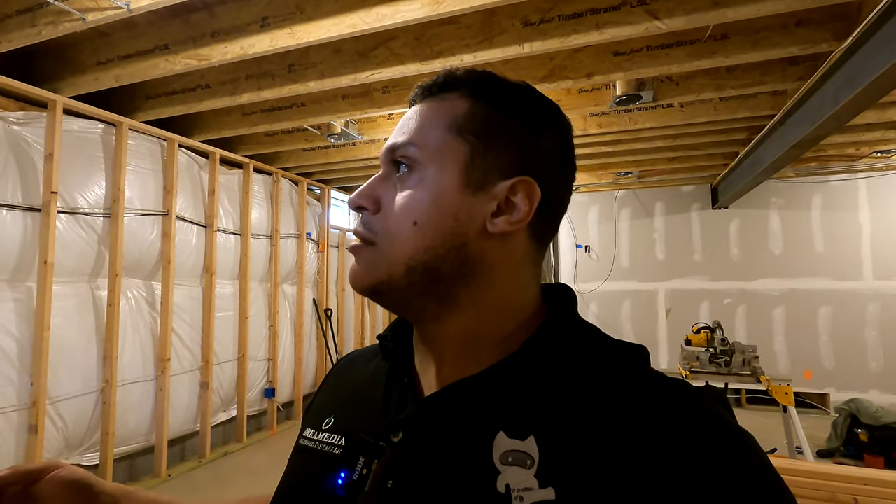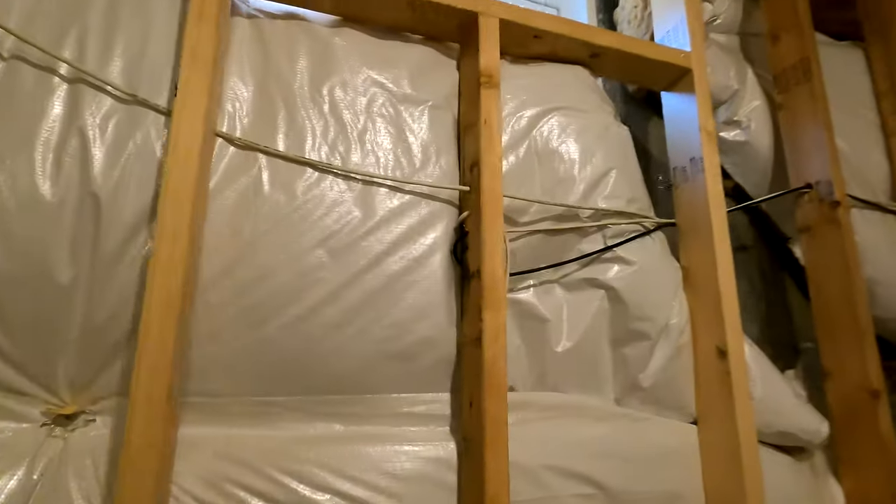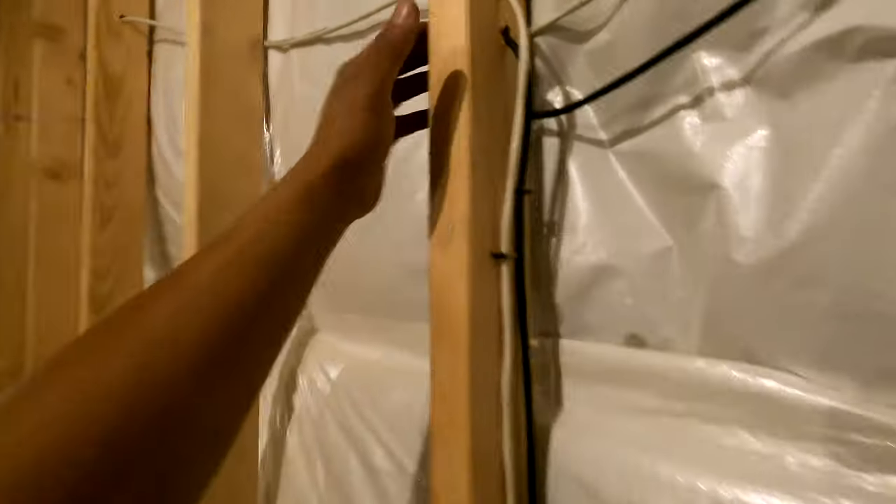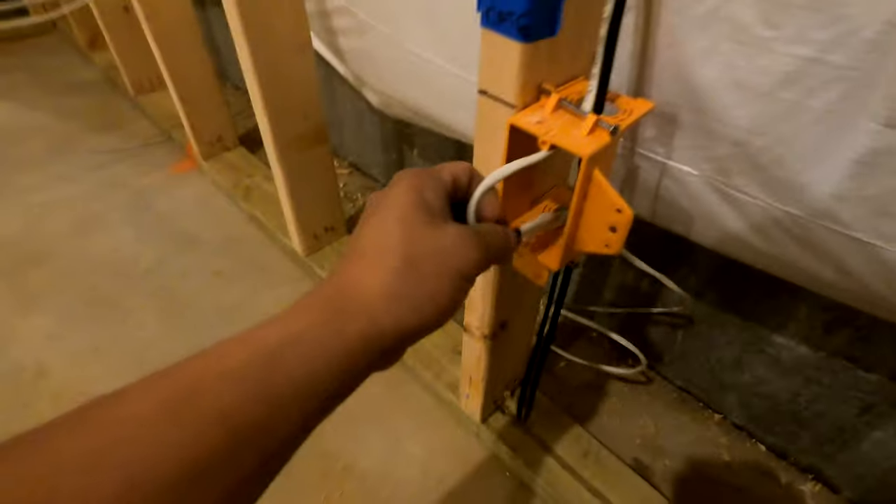In this state we don't have to go through all the studs — we can traverse behind if the walls are gapped. I like to keep cutting at a minimum; if we don't have to cut into all studs, why cut into them? As long as the job has integrity and will be long-lasting, it's more efficient and saves the homeowner labor costs. These wires are for the center channel — they drop down. I drill out and send them down the same side of the stud that the gang receptacle is going to be on. Wires come in the top through the bottom, and the heads come back up — so on install day we simply pull the wire through and we have the head of the wire ready to go.